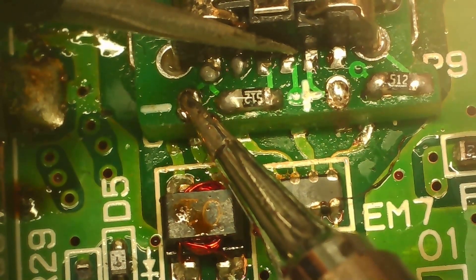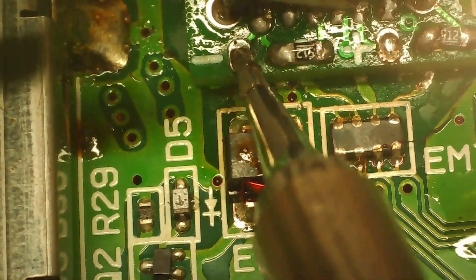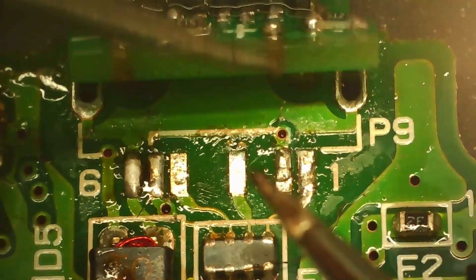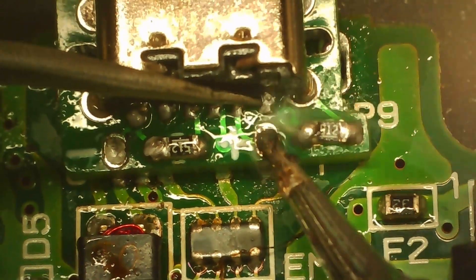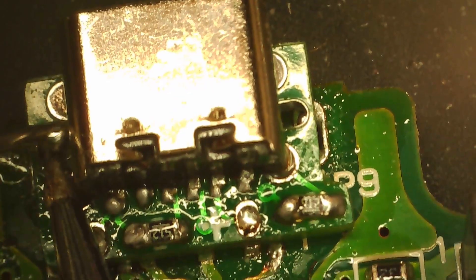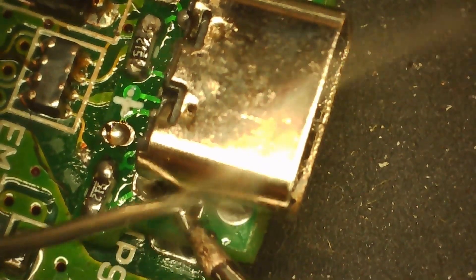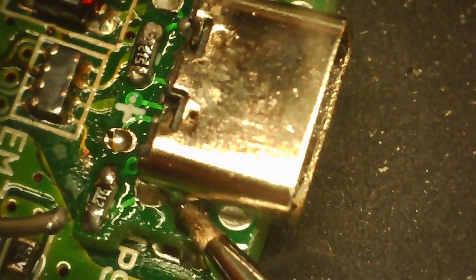Here's me putting it on, and here's me struggling to put it on for a lot longer. I actually had a lot of difficulty putting this on — it just kept flipping up on me. But at least after that side was done, this side was way easier — I just put the soldering iron on and it was done. The mounts were super easy too, just put some solder on. Just add a whole bunch of solder until you see it flow all the way through, and it's done.